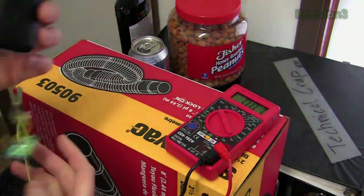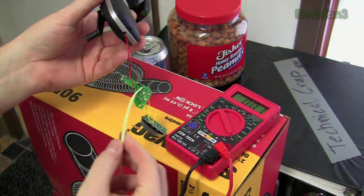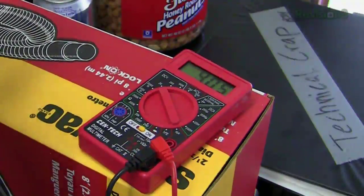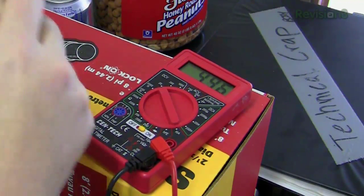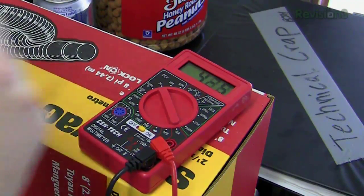Let's see what we can get out of this little generator. We removed the batteries and hooked up the multimeter directly to the rectifier, so we're just going to see what voltage we can get out of it. It's not too hard to get five volts out of this, so this might be a better candidate than the first one we tried.